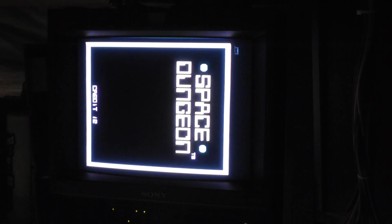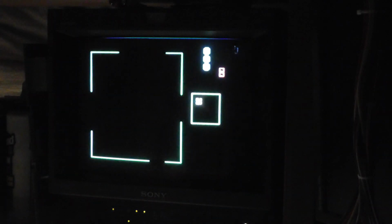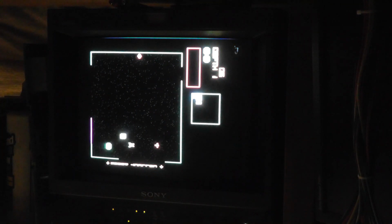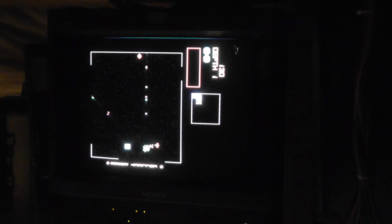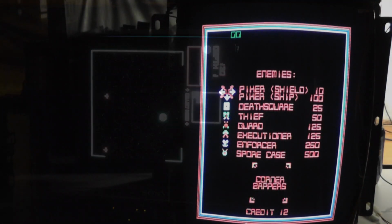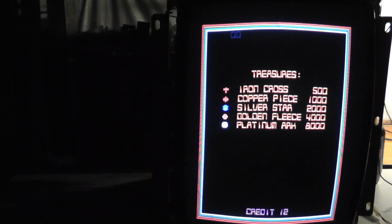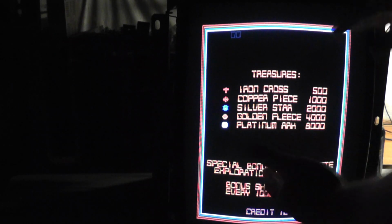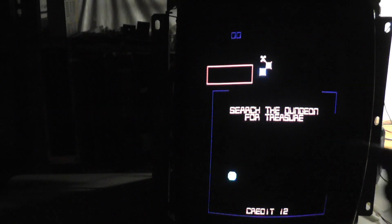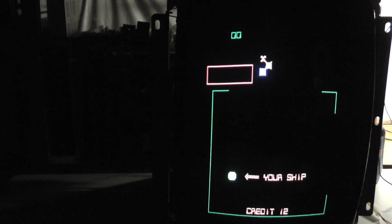Alright, so and that's it. And if I just play really quickly, or try to, you can see that looks pretty decent. So let me pause and then let's look at the game on the replacement monitor. So I have the tube hooked up. I had adjusted the width coil to the widest it would go. So that's as much as the screen is going to take up, and then I adjusted the vertical size just so we could make sure we saw all the picture on there.